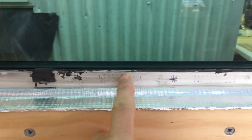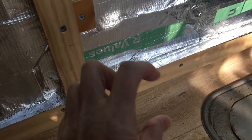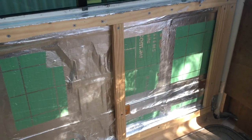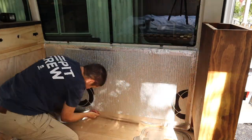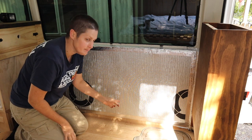I've put little dots on the windowsill corresponding with my screws, so I've marked all of those. Down here I've also marked the height of this batten, because it doesn't sit directly on the floor — it's a bit off the floor. Now I'm going to put the insulation back on this section so you won't be able to see any of this. Once that's done I'm going to line this with the shiplap boards, screwed into those timber studs inside the wall.